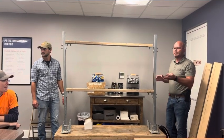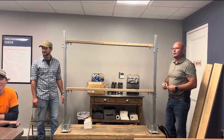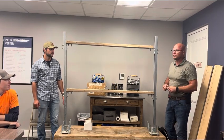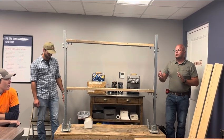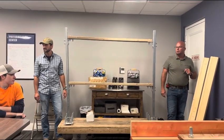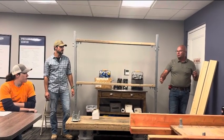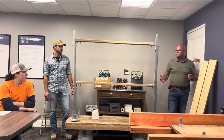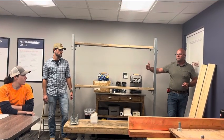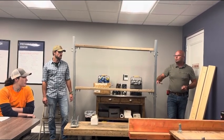Have you ever set a four-foot column? Most are probably very tall, aren't they? Tall ones have quite a bit of play — you can rig them and do all kinds of things. But as you do that, what does that do to the next column in line? It pushes it out. So anything you do here just sets that projection as you start to move to more critical areas of the building — elevator pits, exterior walls, etc. It doesn't go away. You're just carrying that problem, rolling it to the next thing, to the next thing. As you keep going, it becomes more and more difficult to make the connection.